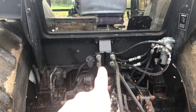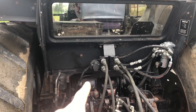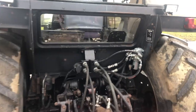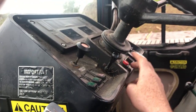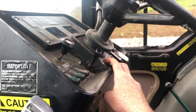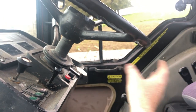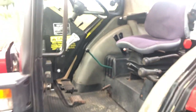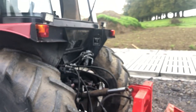I built a new chest valve holder and put the four valves together and wired a new seven-pin plug on it because the other one wasn't there — it was just tucked in underneath the cab. Basically what I have here in the dash is one lever and a button on the dash that I wired. When I push that button and use the lever while I'm holding it, it'll work one valve, and when I let go of the button it works the other one. So it just switches over electronically, allowing you to have two spool valves working on that electronic switcher. It works perfectly for what we want it for.